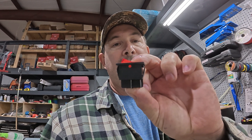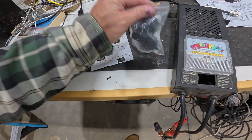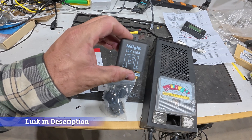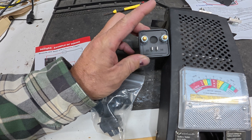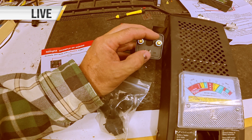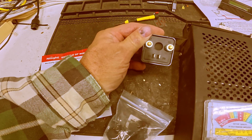This is the switch that came in the unit — rated at 16 amps. This unit pulls a 100 amp load to run the test. I bought some replacement switches, but I'm going to take this a step further. I bought a relay rated at 120 amps. You connect across terminals 85 and 86 to energize the coil, and then it makes contact between 87 and 30. A relay takes a very low current across those small terminals — there's a magnetic coil inside — and it pulls a larger current capacity contactor between 30 and 87.